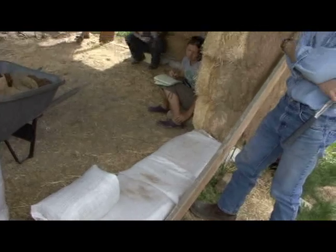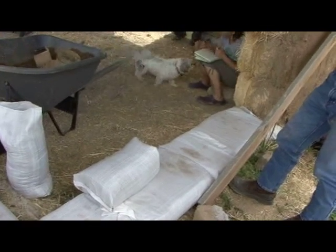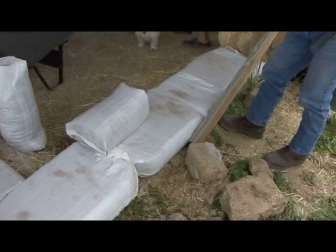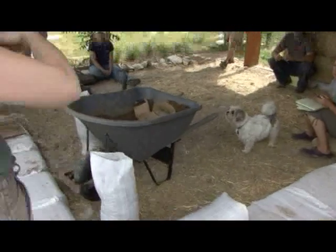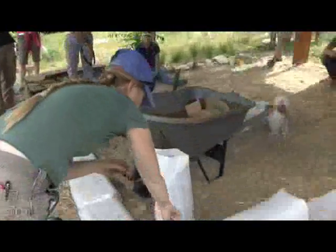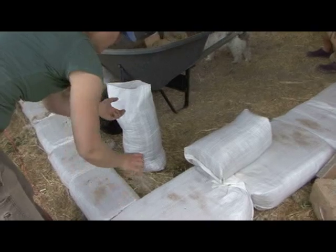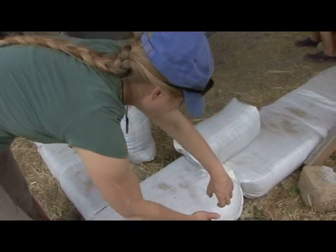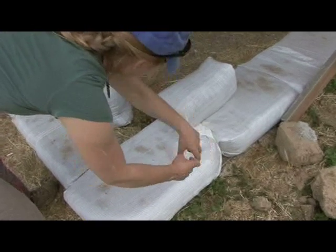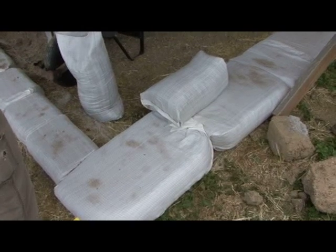So, at this point, I would lay the two courses of barbed wire, and Donnie and Packy developed this very neat little process with baling twine and bricks and a carabiner. They wind the twine up around the brick and lay the end of it underneath the bag or even tie it up over the first bag. The barbed wire goes here, you unroll the brick, so that it's got some hanging weight to it. You don't want to drop it on the ground. Carabiner it to the string going across. That weights down the barbed wire.